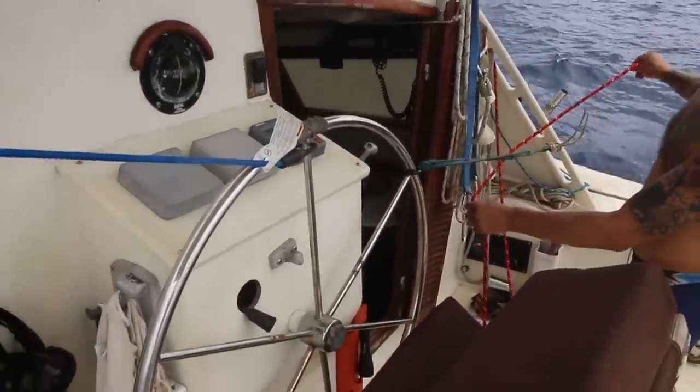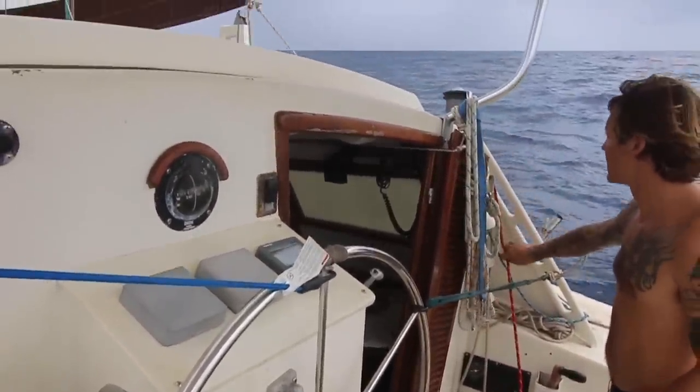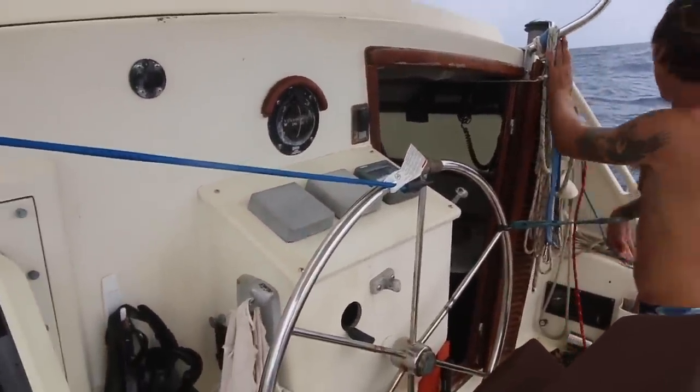We're 400 miles offshore. Our bungee cord setup is working really well. And I'm fairly confident that this old plastic ring, if I just reinforce the three places where it's being held, is going to be fine. I've got to wait for them to dry. So it's going to be probably a 24 to 36 hour fix, which means tonight, all night long, we're going to have to hand steer, regardless of whether we turn around.